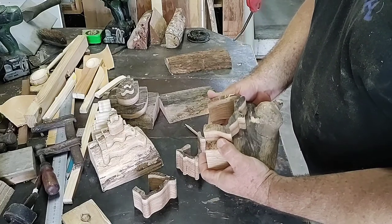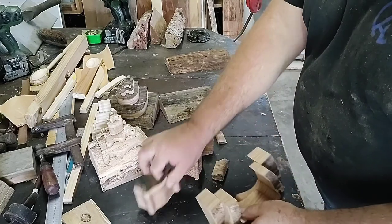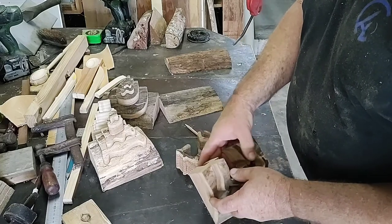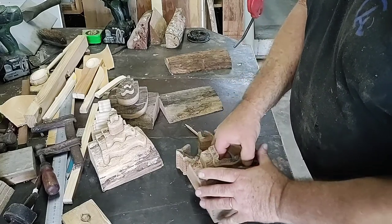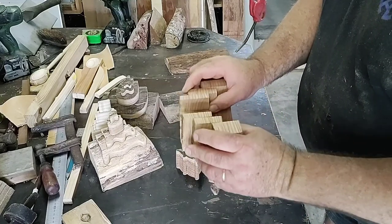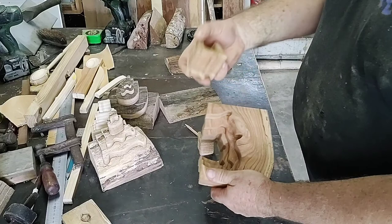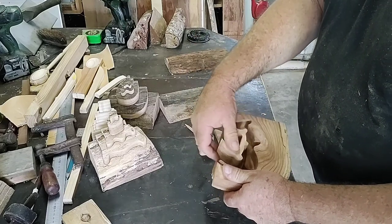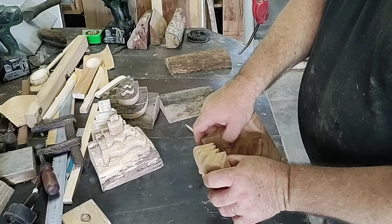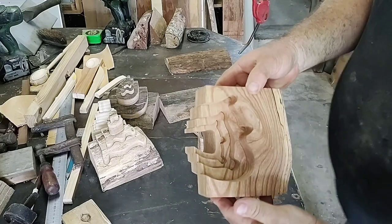Notice how the taper holds it in nice and firm. And it's imperative that you cut it the same way every time. Once you work out the angle, so it makes it wider at the bottom and narrow at the top, it's imperative you cut the same way. Cut one wrong, it wrecks the whole castle. Cut it too loose, you can glue them, but then they're a rigid fixture. You can't push them down in themselves.